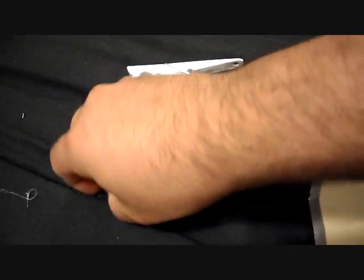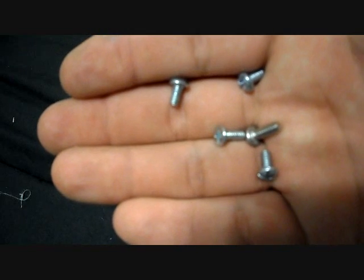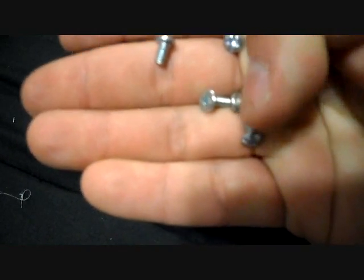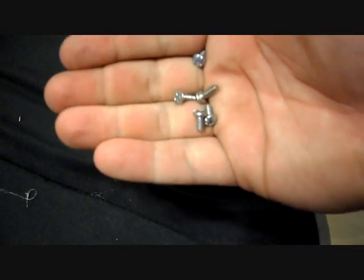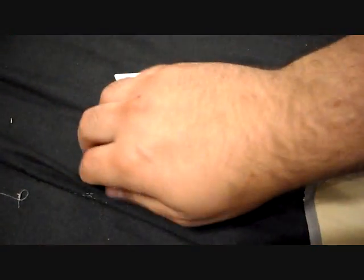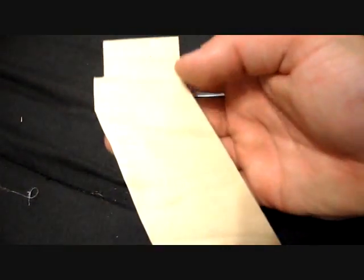Then we need a myriad of small bolts. In hand I have three 3/4 inch long 6-32 bolts — I use those to help hold the epoxy putty on the inside of the triggers. And here we have a flat 6-32, 3/8 inch length screw that helps hold the trigger together. Then we have one of our 3/8 inch screws, the same ones used on the bushing and the plunger head. And I also forgot to mention our wood handle template — this is just a modified rainbow pump handle; I shortened the top of it by a little bit.